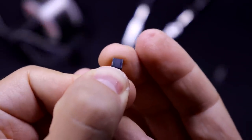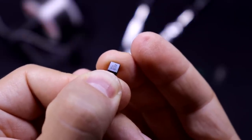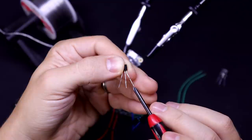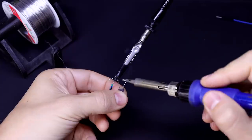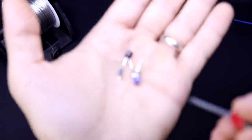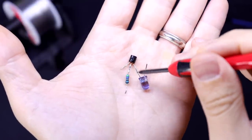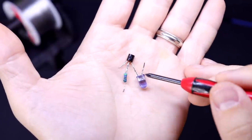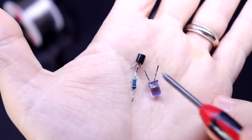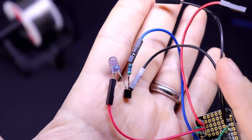Put simply, a transistor is a switch that you can control with an output pin on the feather. This one is an NPN transistor, specifically a 2N2222 transistor. The middle pin connects to the output pin on the feather, which will control whether a ground connection is made through the outer pins. It'll make it so that we can power it from the 3.3 volt pins on the feather, giving it much more current to work with and making it work from farther away. If you hold it with the flat side facing down, the 470 ohm resistor is connected to the middle pin, and the other side will go to the blue wire. The right side is connected to the ground pin on the LED, and the other leg of the LED will go to a 3.3 volt pin on the feather board. The left pin will go to a ground wire. Again, give it a try before adding this — it worked fine without a transistor on my TV, but it may make it work better if you're further away.